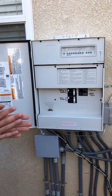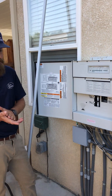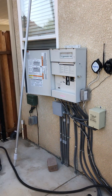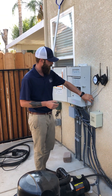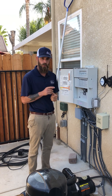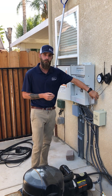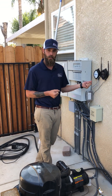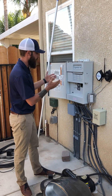If it keeps tripping, please call Premier Pools and we will have someone sent out to take a look at it. Right here we have an outlet — this outlet is hooked up to the lights. So if we turn on our lights and they're not working, come out here and check if the outlet is tripped. If it is tripped, it's just like the outlet inside your kitchen — just reset it. You're welcome to plug anything into it, but if it is tripped and the lights aren't working, unplug what you have plugged into it and see if it's the lights tripping the GFI or if it's what you have plugged into it. That is our automation system.